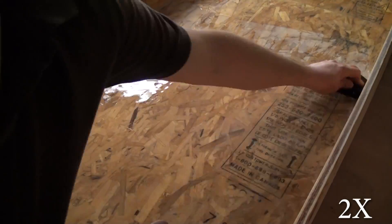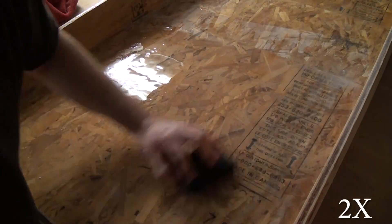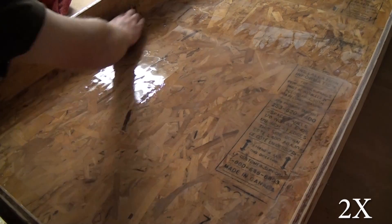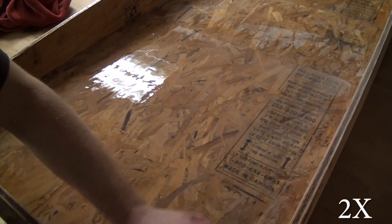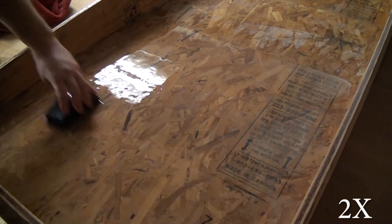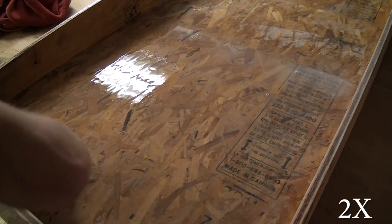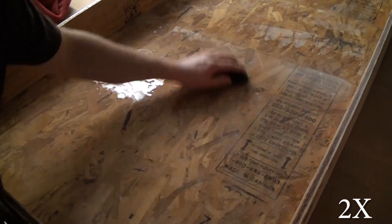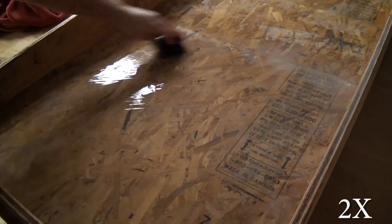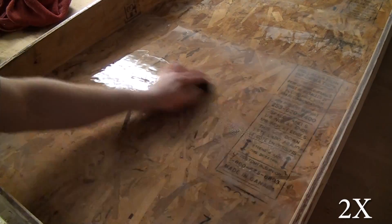So you don't want to overwork the material, and that's why I think you don't necessarily need the six-inch roller. I tried dry sanding with my orbital sander using an attachment hooked up to a small shop vac, but I was making very slow progress. Then I read online that you're supposed to wet sand with 250 or 400 grit sandpaper — wet sanding really cuts the epoxy fast. The process is: blow off the wood, get it clean and dry, do your first coat, let it cure, sand it, clean it, let it dry, then do your second coat, sand it, and so on. After my last coat I also sanded before painting, and it came out pretty smooth.